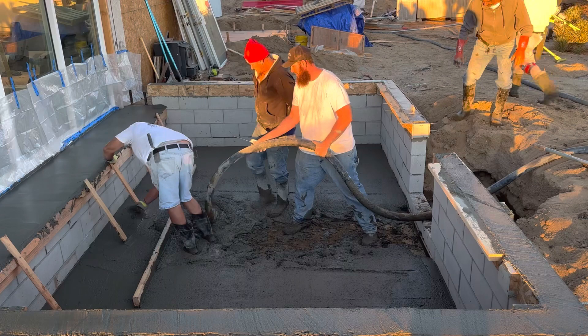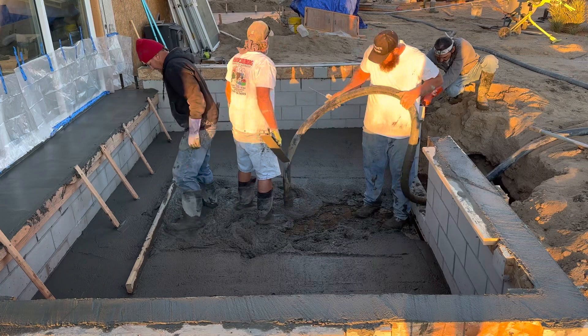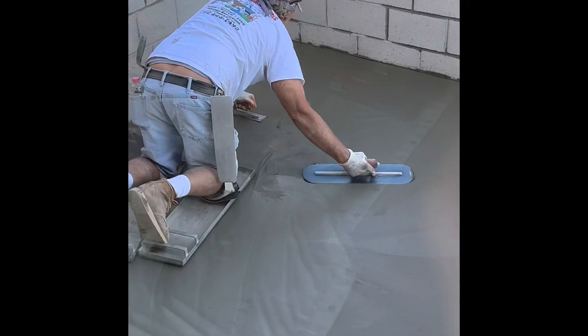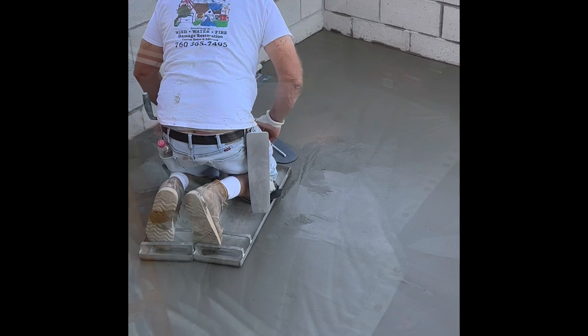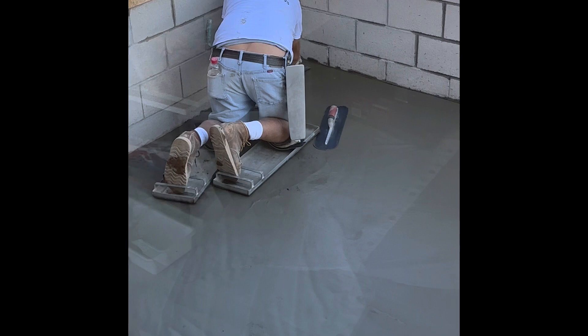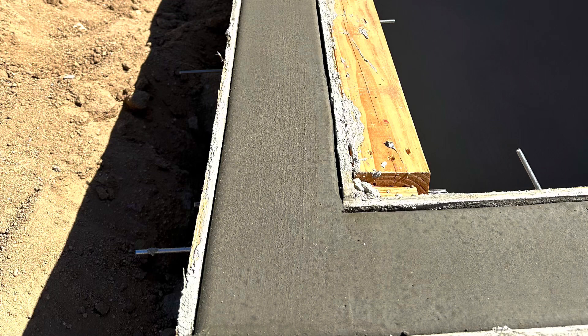After the cap is poured and the landing was poured, the last thing they'll do is the actual slab itself. This is a five-inch slab. They'll start to generally shape this, then do some finish work to get it nice and flat and smooth, and they'll do a little edge work too and clean it all up. This is about a six-hour process. Getting the pour — concrete sets up pretty quick — so we had six people on this one. It probably takes about four or five hours to get to this finish point.